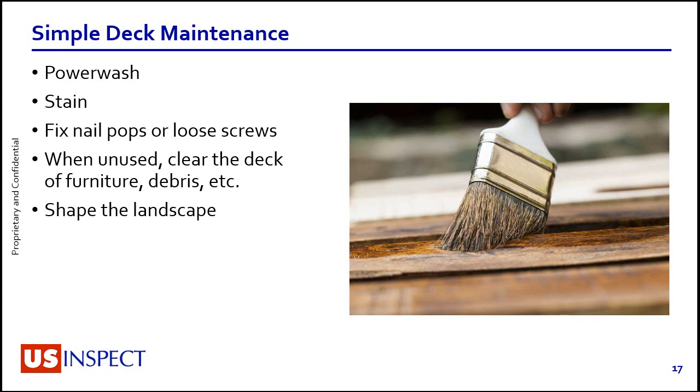Make sure you get plenty of sunlight and airflow to the deck so you don't grow mildew, fungus, or other growth that makes you have to clean it faster than you otherwise would. If you're not going to be using the deck for a while and the sun will be beating on it, move the furniture around periodically so you don't end up with areas of differently faded stain. You've probably seen a similar thing in a vacant home's dining room — a rectangle of differently colored wood where a rug used to be. You don't want that out on your deck either.